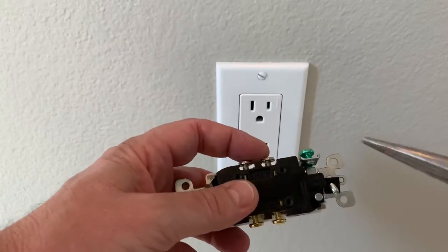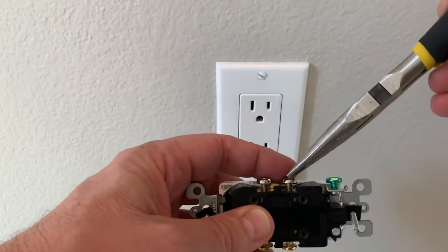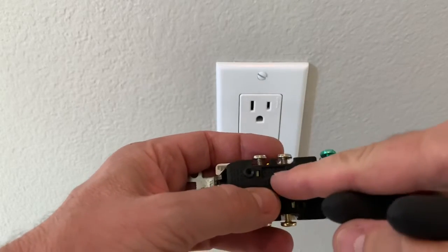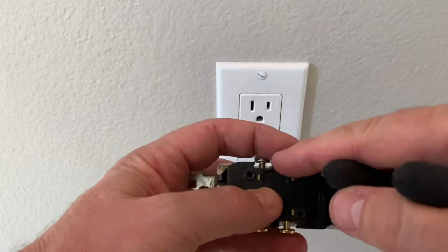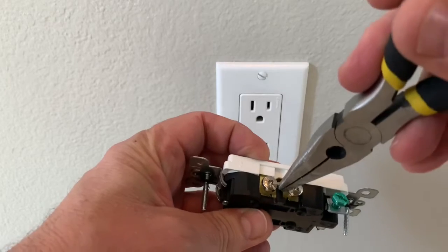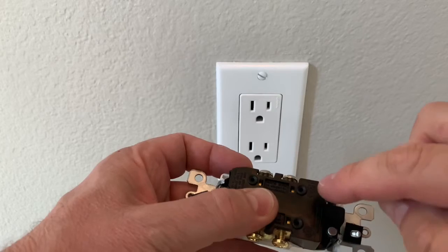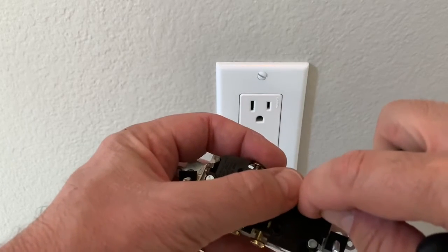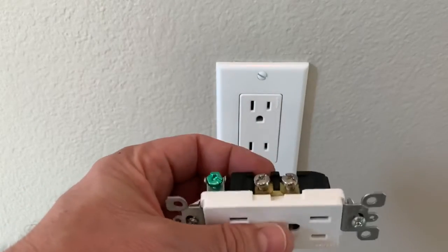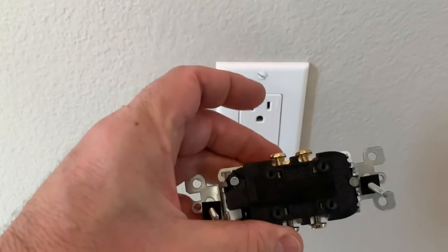Also, there are outlets where you stick a wire into the back and tighten a screw. If you unscrew those on some outlets you'll have to get a new outlet, because there's a little piece inside that snugs up as you tighten the screw and grips the wire. Alternatively you can wrap around the screws or use the push-in hole with the bent piece of metal in the terminal. I don't like that because it seems to fail a lot. Check your outlets before you start — if you can move these screws in and out you do not want to remove them completely.